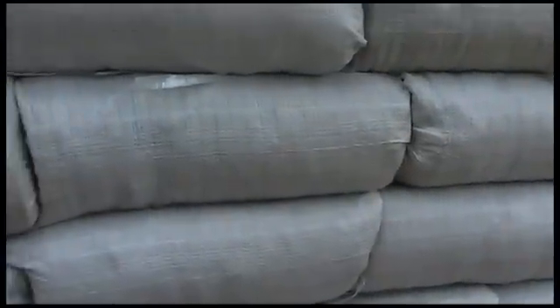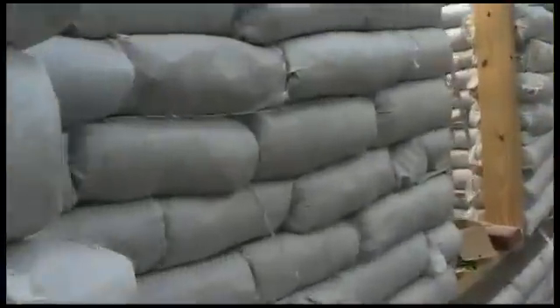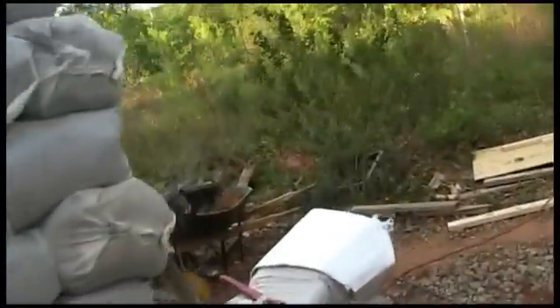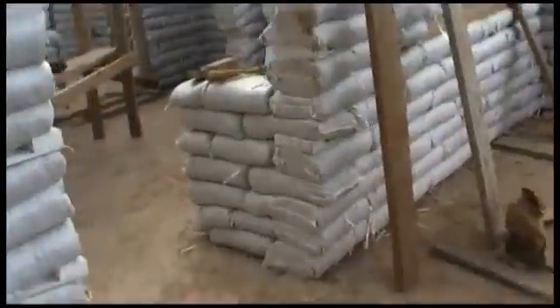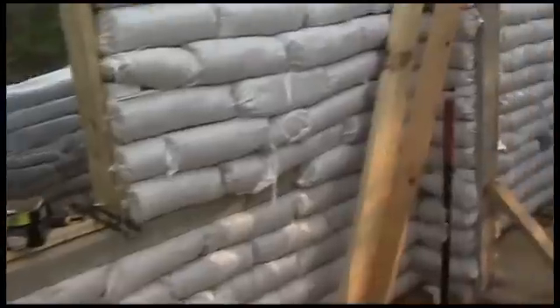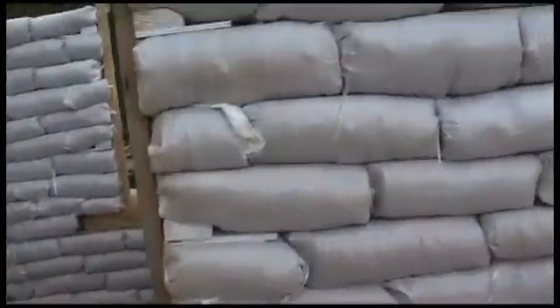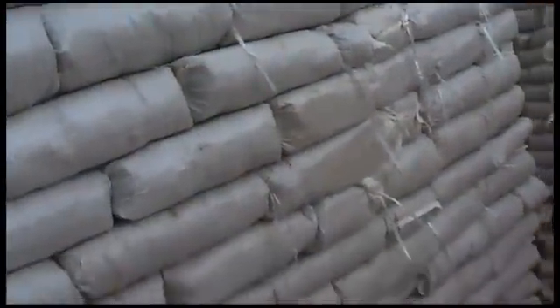What's interesting about these bags is that because it's a foot of solid compacted clay, it has a really good R-value — some of the best insulation you can get. We're actually building the house with the inner walls done with it too, so instead of having sheetrock, it's going to be much more solid inner walls.